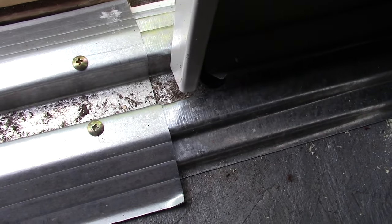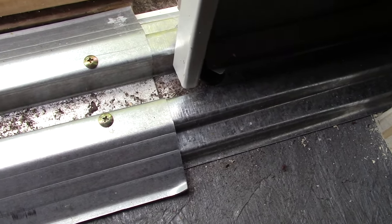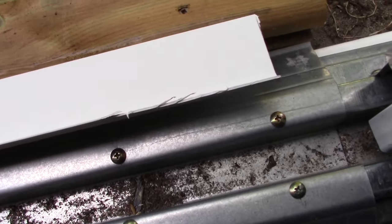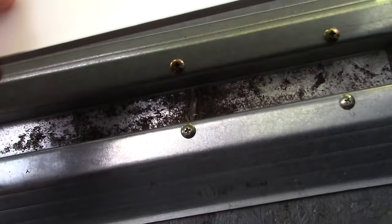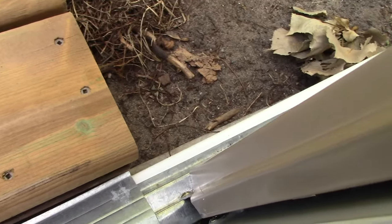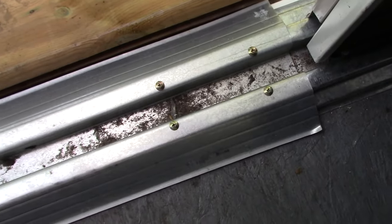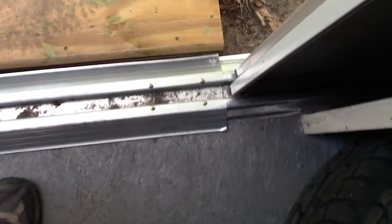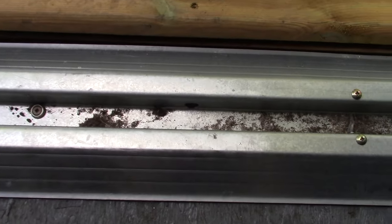There's a bit of a step down to the rest of the framing here. As you can see, this is the stuff that we put in — it goes to about here, it runs halfway, so that's basically where it ends up. It ends up underneath here, which is fine for the outside part, but for the door it's not deep enough, and unfortunately there wasn't one that was deep enough. What'll happen is the water will come in through the drains and then leak onto the floor here and run into the shed — and that's what's been happening.